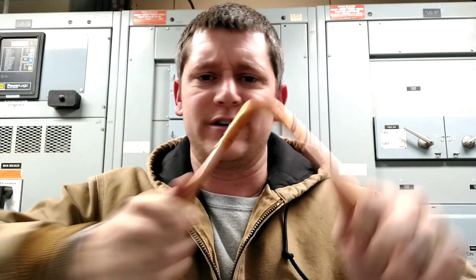There are a couple of things to note. If it does leak, you can't just braze over this — you have to cut it out. You can't remove it once crimped, and if you melt that O-ring you're in trouble. Other than that, it's seriously just as good as brazing when you look at the stats, especially from what RLS has provided. You can get on the website for tons of data. One con is this set costs thousands of dollars — it isn't cheap. Unless you do a lot of piping work, it's probably not worth getting. But if you do a lot of it, you can get jobs done in no time.